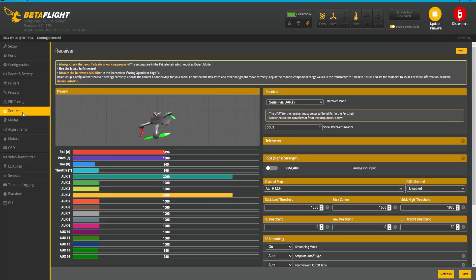Let's move through real quick. We've got yaw — good. Throttle is good. Roll is good. Pitch is good. We went through all the steps, and those steps are important because 9 out of 10 times you will fix this problem without having to go this far. But if you have a Vista and you've reached the end all be all, there's your solution. If you're running a Vista with no OSD and you've run through all the steps, remove the RX or TX diode — if it's shorted, it will prevent communication from passing. I'm super excited it worked and I'm super excited to try out my new build. See you on the next one!